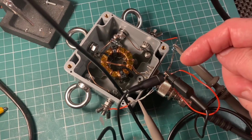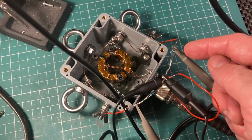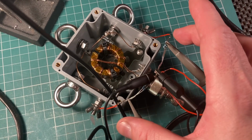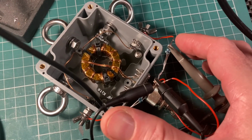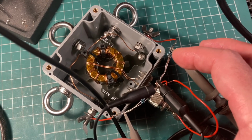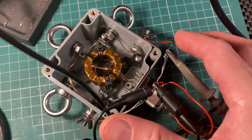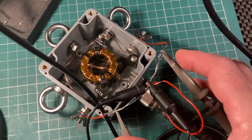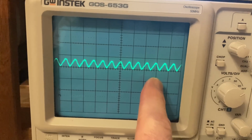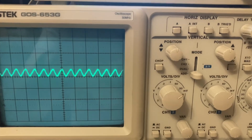For a 1 volt peak-to-peak input, I'm getting 12 millivolts difference, which is 1.2% error in terms of balancing the currents, because we are measuring currents, because when you measure the voltage to ground through a resistor, that's the constant of proportionality. The current is proportional to the voltage across the resistor. That's Ohm's law. So a proxy for measuring the difference in the current at the balun outputs is on the order of 1.2%.